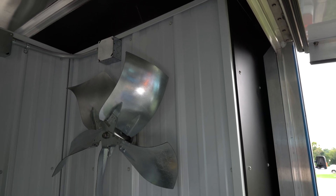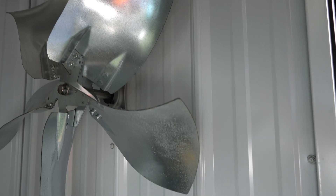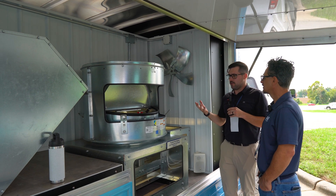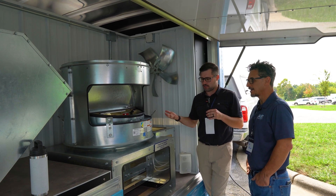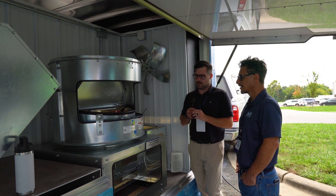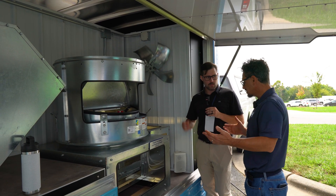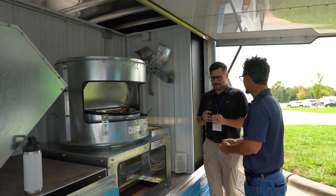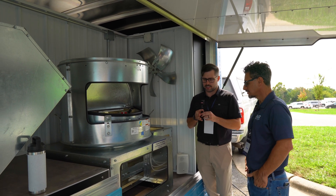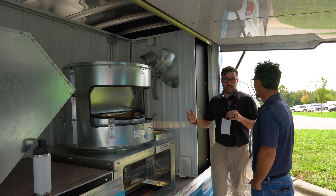That's what this blade design is — you'll notice it's a swept blade design, really designed for that high CFM area. Versus if you had a power rooftop ventilator or a restroom style fan, that's going to give you a higher static pressure, lower CFM for ducted spaces — just a different fan. You use these typically on the roof of warehouses; you'll see them in lines. So the warehouse that's not conditioned but they want to pull some ventilation through? Exactly. Typical ventilation rates are one to three air changes per hour, and they can put these along to change out that really large volume. That can make a huge difference between 110 degrees and 85 degrees.